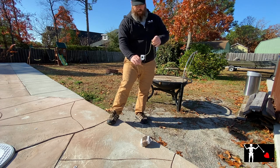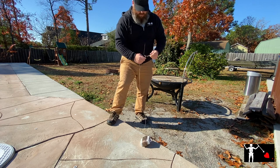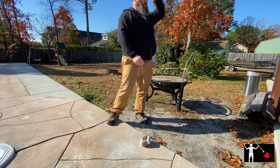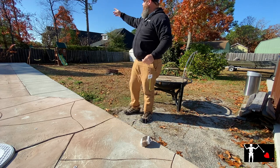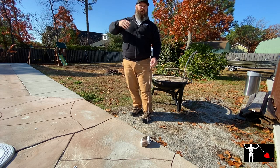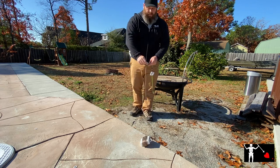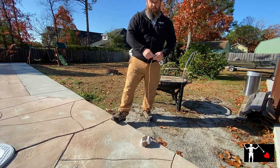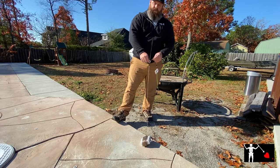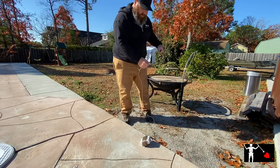Now when I pull it up, I'll pull the whole wire up. I also have this other insulator — again, just another part of the cutting board I cut out. If I have tall pine trees — and since I'm in North Carolina, pine trees are really prevalent — and I'm going to a park with a pine limb 45 or 50 feet in the air and I'd love to do an inverted V, I need the middle of my line up somehow. I can throw the line over, connect to the center insulator, and only pull up the middle while already having the end staked out. So now that it's hooked up, let's go to the other side.